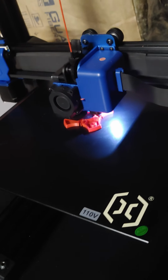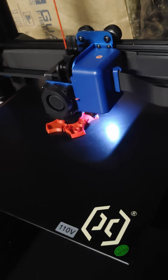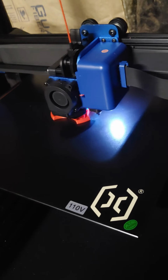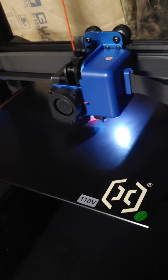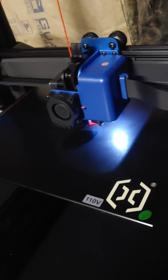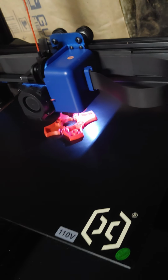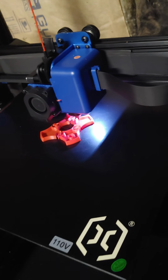To kind of explain it, this is part of a system of a rocket that does several things. First of all, it has a tank filled with alcohol. And as the motor burns and heats up, the alcohol is there as a coolant and as a thrust enhancer, because as it gets hot, it's going to vaporize and go down into the channels into the blast cone and enhance the thrust of the motor while cooling the body of the plastic too.